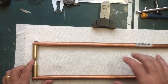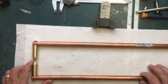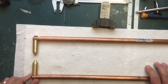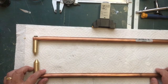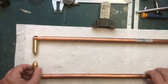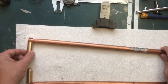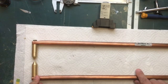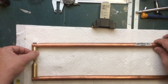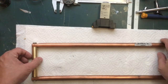There are probably countless ways you could do this, which is another reason why I'm not giving step-by-step measured drawings - I don't even know if this is the best way. I'm just hoping that if you're wanting to build a spot welder, you can get some ideas from me. I highly recommend watching all the other YouTube videos on the subject - you'll get a few ideas from each person. I also need to work out the clamping mechanism: one rod will be solid and stationary, the other will be on a pivot with some kind of bistable latch mechanism like vice grips.